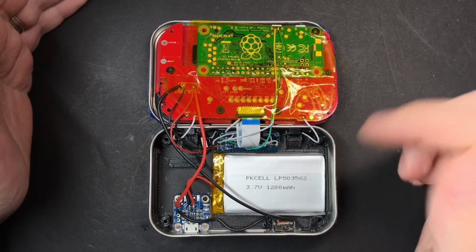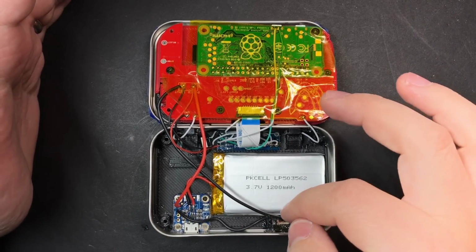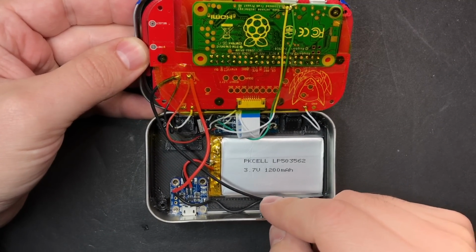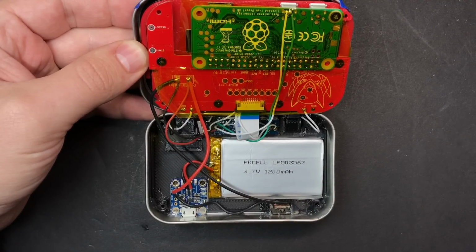Alright, so you remember earlier when I was setting up the power switch, and I added that big note that said, just kidding, put the power switch on the red wire instead of the black wire. Here's why. With the way that I have it set up now, we're basically connecting and disconnecting the ground here with the ground up here on our controller board.